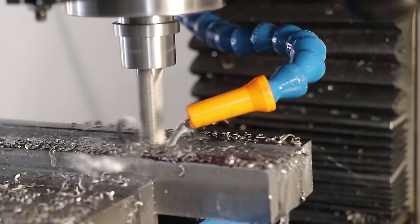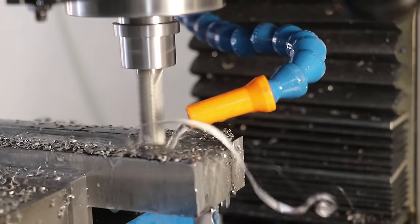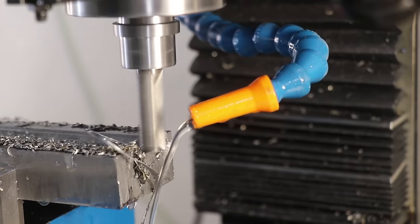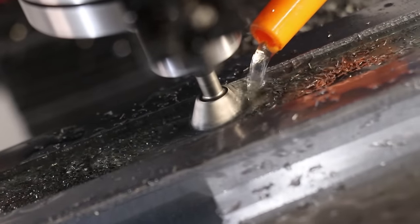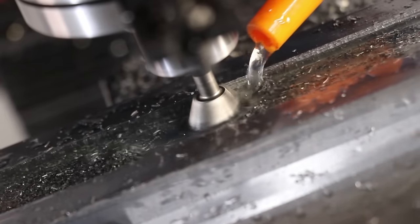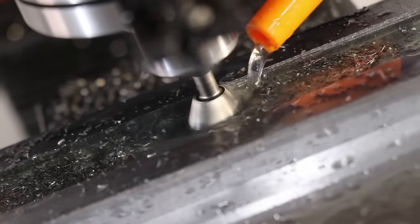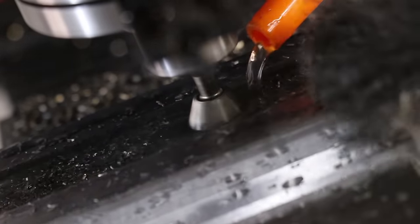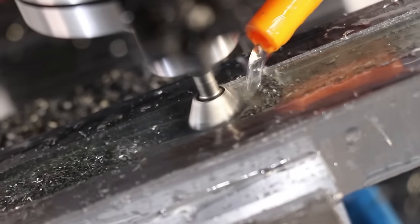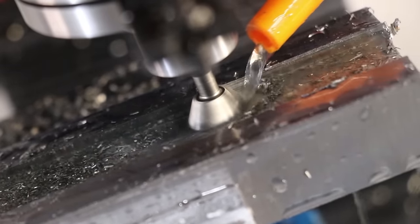Overall, I'm very happy with how it turned out. It's quiet, it works well, and the total cost for setup was about $120. I'll probably stick to using this when I'm doing very heavy cuts in steel, and I'll also keep some in a jar or spray bottle for very light cuts. From here on in, I probably won't be able to use any of the old mineral oil or kerosene, because you can't introduce dissimilar oils to the coolant — they don't mix, they just form a layer on top, which can allow bacteria to grow. In the near future, I'll also have to get a refractometer, which will allow me to check the coolant concentration. The concentration will change over time as water evaporates and you lose oil to run-off with the chips, because oil likes to cling to the chips — so you do need to monitor it. It may seem like a bit of a hassle, but it's just another part of the mill that needs to be checked up every now and then.